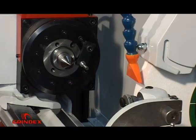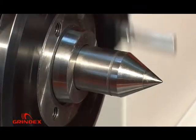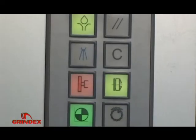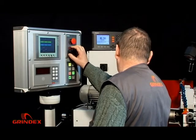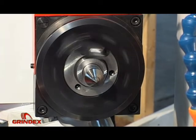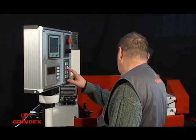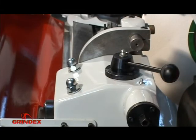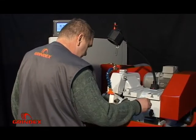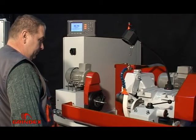Work head. By alternating pushes, the work head motor is turned on or off. Work head speed is regulated by potentiometer in the range of 20% to 100% of the programmed value. There is an option in which the work head works as long as the button is pressed. Tail stock spindle movement is possible by lever or foot pedal at the bottom front side of the machine.